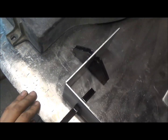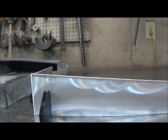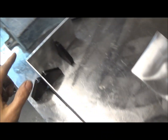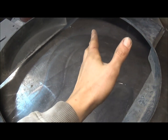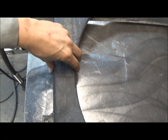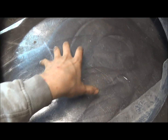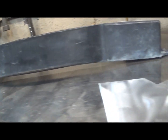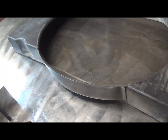Got some pieces ready to tack up here, and you can see that I've got that same taper on there. We're going to start getting this tacked up. I'm going to work from this side over to this side — that seemed to be the best way. This side over here is quite a bit wider than this side, so it's almost like the fan isn't sitting directly in the center of the shroud. Also, it's kind of warped in the center real bad, which is just due to time and age.